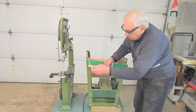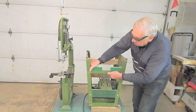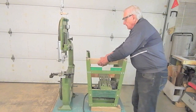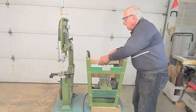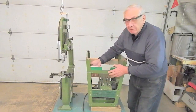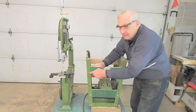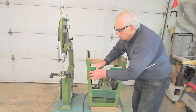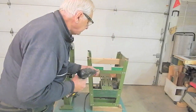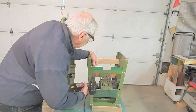In both pivot blocks, I drilled five-eighths-inch blind holes so that the pivot blocks will slip over the nuts on the inside of the angle of the stand — same thing on the back. Before drilling these holes, I used a heavy-duty C-clamp to pull the block against the bolts to make an imprint, so that when I took this over to the drill press I could drill in exactly the correct location for the blind relief holes. These pivot blocks are retained with a couple of three-quarter-inch round-head screws through drilled holes in the stand frame angle.